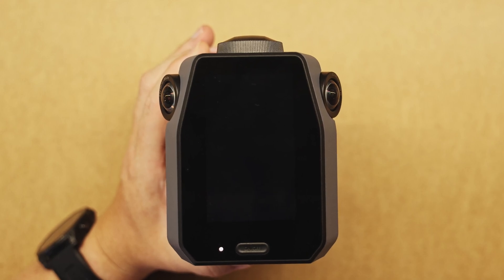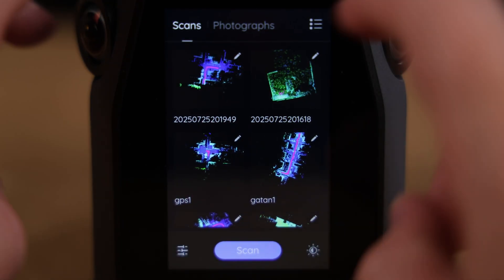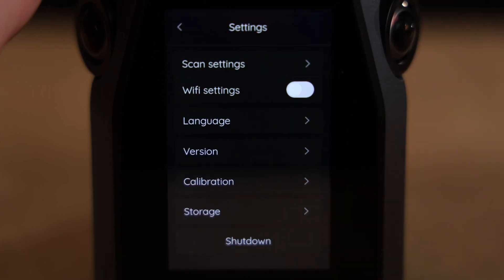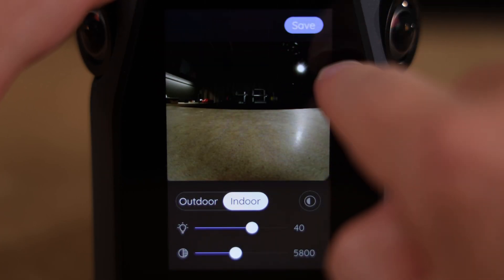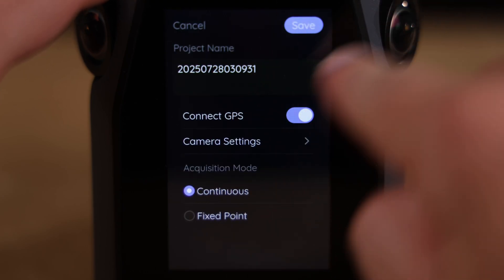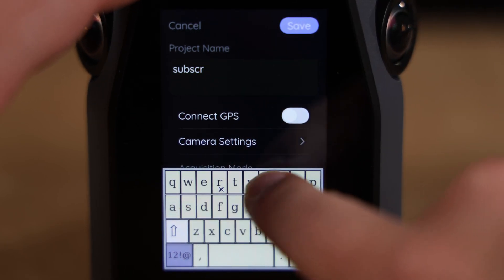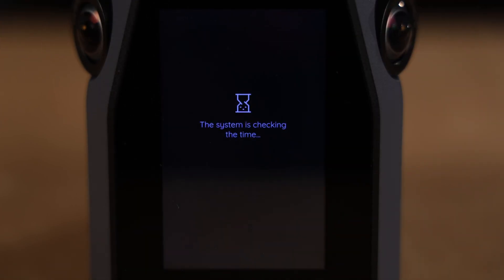Press on and wait for it to boot, then you come to your scanning overview. Click on settings and scan settings — I usually go with medium accuracy and high point density. Then adjust the brightness; you can choose indoor, outdoor, or set it manually. There is also auto exposure coming in the next firmware. Save that, go to scan, connect the GPS if you have an antenna connected, use continuous mode for handheld, and change the name to something fitting.